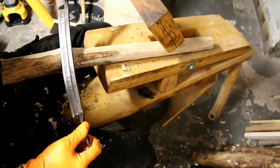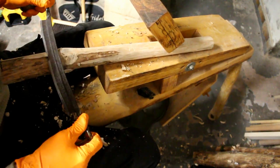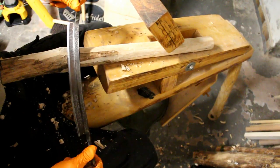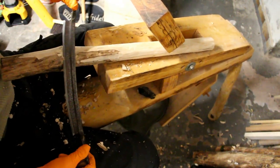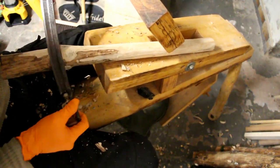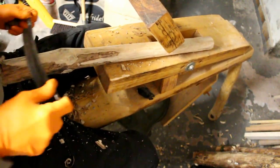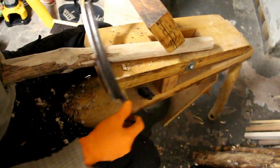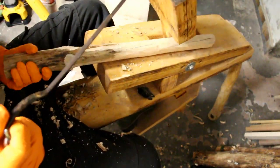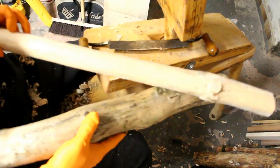You can also use the draw knife, set it down, and then wiggle it in, and then back off with the cut you're gonna make. If you have a really difficult spot, like at the bottom of a knot, you don't wanna make a mistake, or you can be real careful and use short movements like this and work your way forward so that you can get a feel for how the wood is and how your tool is reacting to the surface of the wood.